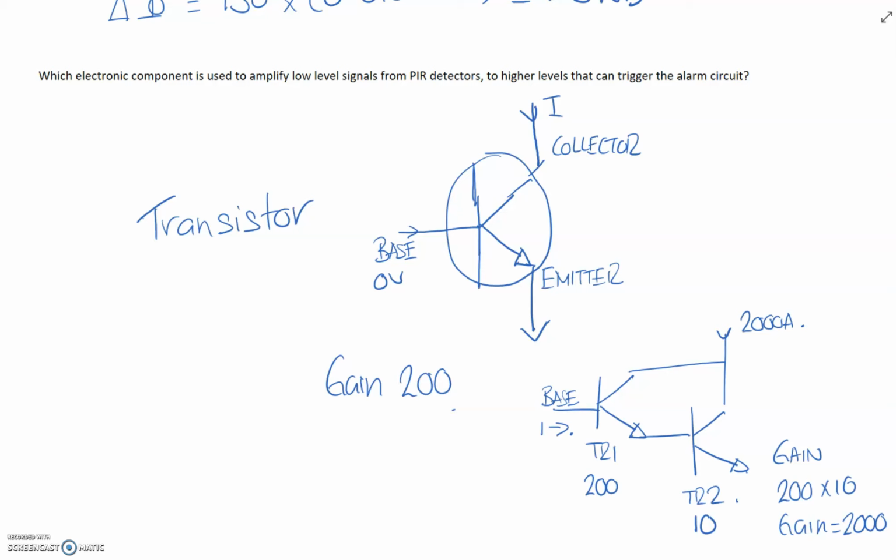So this is a Darlington pair. These are found in boiler circuits, sensing circuits like temperature and oxygen sensors, in flues and control circuits. So many, many control circuits, light sensors, things like that, we use transistors to amplify the signal so we can process and control whatever we want to control. So a Darlington pair arrangement, two transistors, multiplies the gain. Very, very powerful arrangement there.